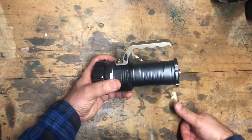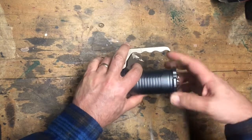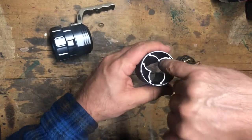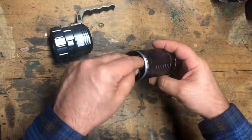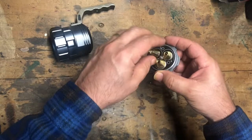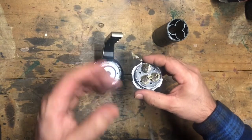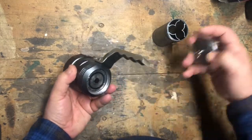Even given the differences, I thought it would be interesting to pull this apart and compare it to Big Clive's one. I won't pull it apart completely or do the full electrical analysis like Clive does, but I'll just go over the basics. The first thing you notice is that the barrel has aluminium machined spaces for three 18650 cells, where Clive's has a sort of holder that goes in. On this end it has three springs for the negative ends of the batteries, which all go in in parallel.